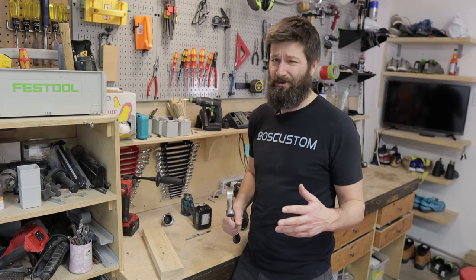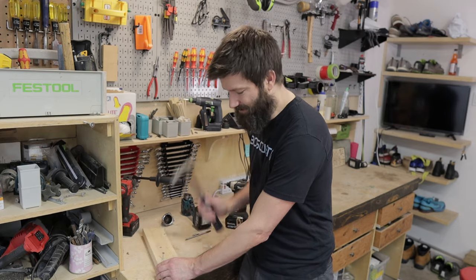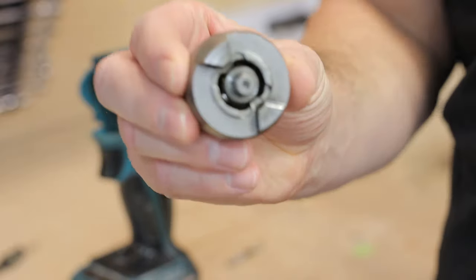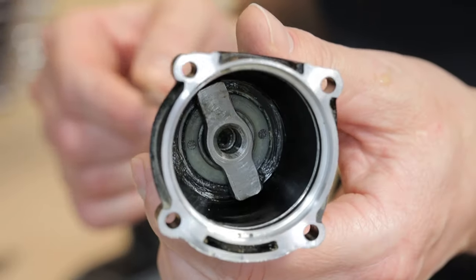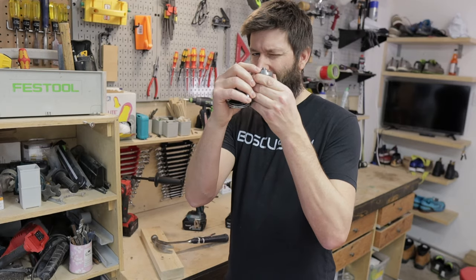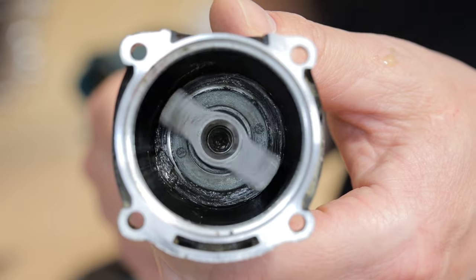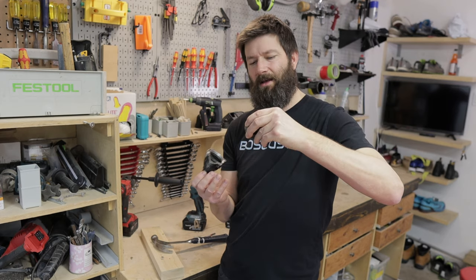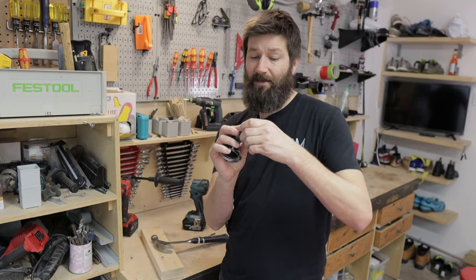What an impact driver does instead of continuous pressure — it's a hammer, it impacts. The way that manifests in the impact driver is it has a little rotational hammering disc inside the chuck. There's a little T in here that gets struck by these things rotating along, and on these little nubs there's a little angle — they're not quite square, they're sloped in a bit. Same thing on the little T: there's a little slope, so when those two slopes meet, this impactor spins and then supplies that hammering force.